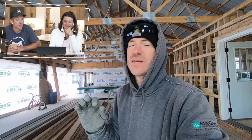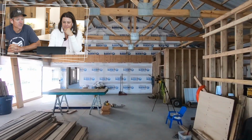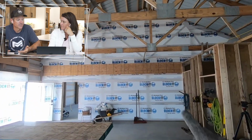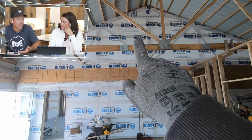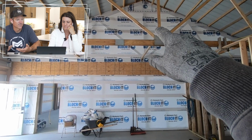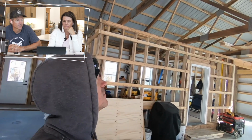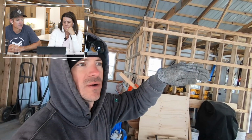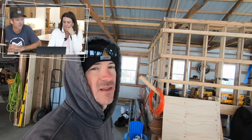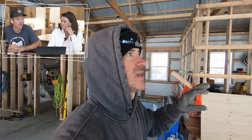That sounds fun. So I guess before spray foam, you just want to make sure... I have a pretty good process now. Before your spray foam goes in, obviously the bottom of your wall is going to be capped off because you're going to have concrete. And then you want the top of your wall capped off. And then any fire breaks that you're required by code in your area, you want to have those in place because it's a lot easier to have them all done prior to the spray foam going in.